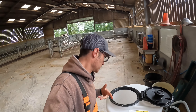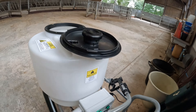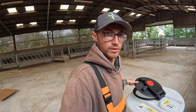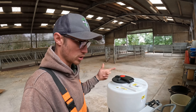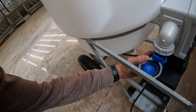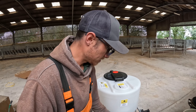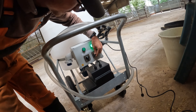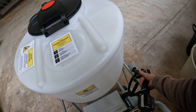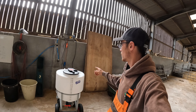We have an adapter to take it to a normal plug in the workshop. What you do is put a certain amount of water in there to start with, then turn on your mixer using this button here. That then starts flying around - you don't ever want to put your hand in there, that will end badly. You then tip some milk powder in, weigh it out whatever you need, tip it in, and then top up with the required amount of water. When it's all mixed you turn that off, disconnect this plug because that is your mixer. Once you've got it over where you want it near your pen, you put out your trough and turn it on using the other button on the side, then it's just like being at a garage - you dispense your milk using this handle.